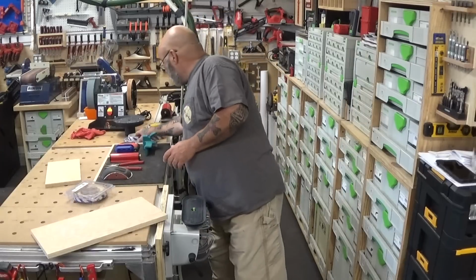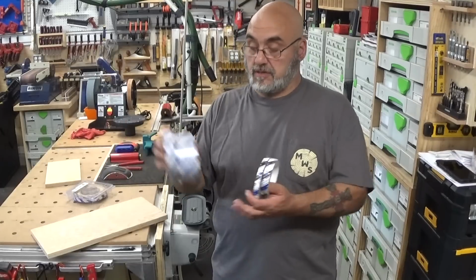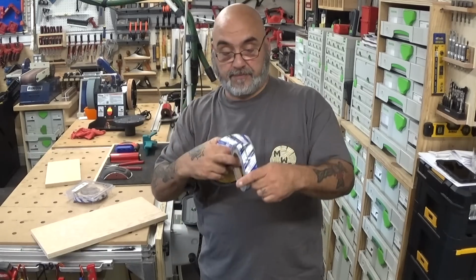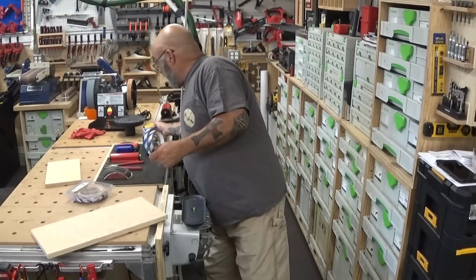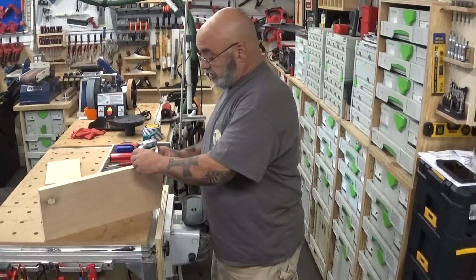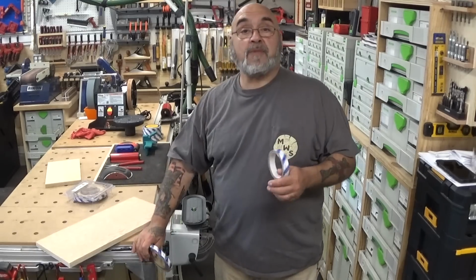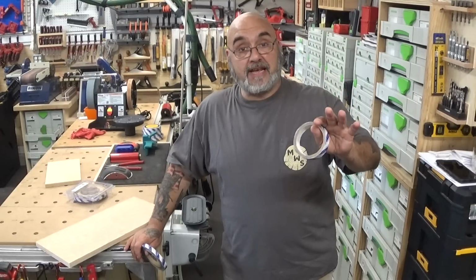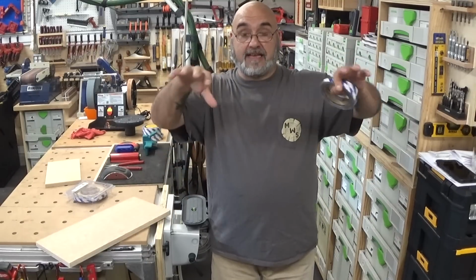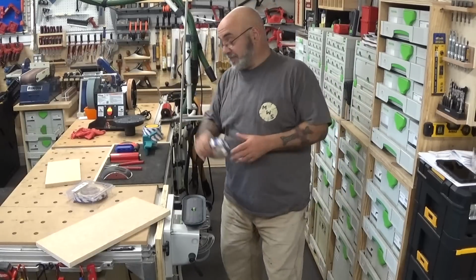They also make this tape, which is like their fast tape. Now I keep 2 inch, I keep 1 inch, and they're 50 foot. I keep 3/4, and I keep 1/2 inch. And if you just have, say, veneer or the old style edging, you can actually lay this out onto the edge, put your piece on it, roll it out, and now you could use other edging. What I like to use this tape for is when I'm affixing doors to a cabinet, I cut 4 or 6 pieces, get it centered, tape it on because it's double-sided tape, then I can move the drawer out, clamp it, drill through the back, and mount the drawer, and then put the handles on. So that's their Fastcap tape.